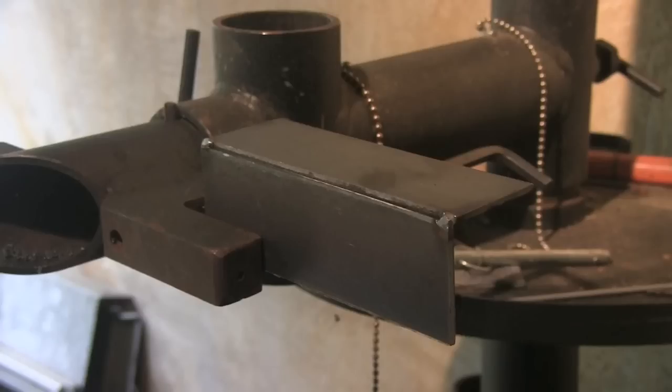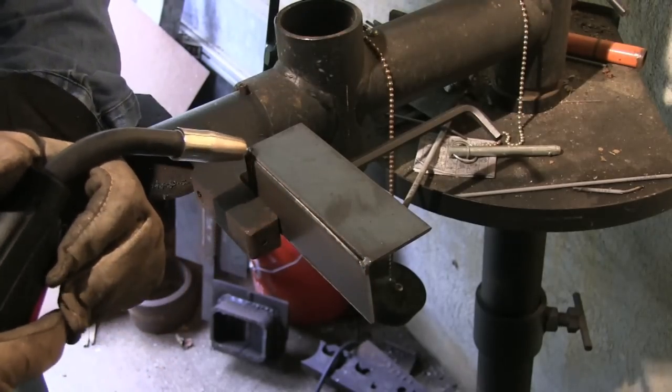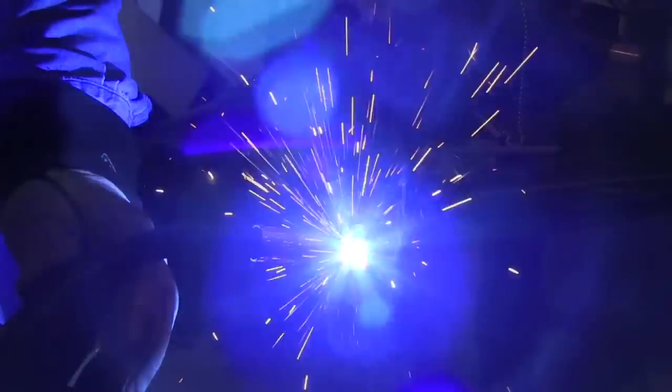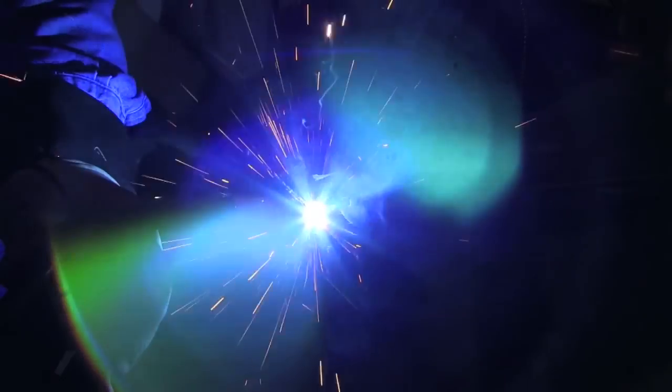This is an outside corner joint in 11 gauge material and it doesn't take nearly the amount of heat that a T-joint or a lap joint would, because of the edges. Edges just don't conduct heat as well. So to set this thing as it calls for for eighth inch metal means I am cooking along — the puddle is almost chasing me, and if I'm not careful and go a little bit slow, it just gets out of hand. It piles up and it's hard to see where I'm going.